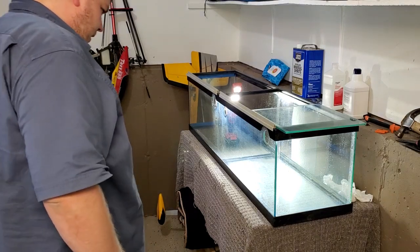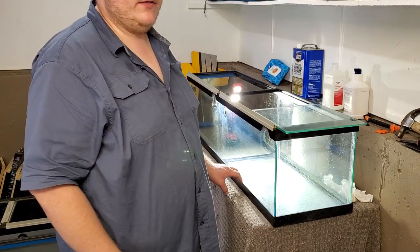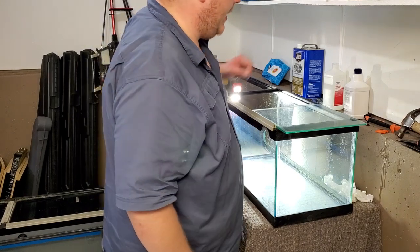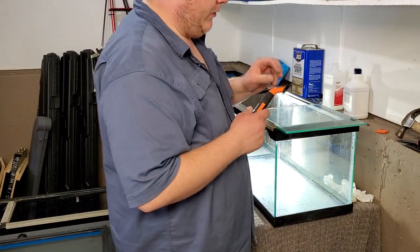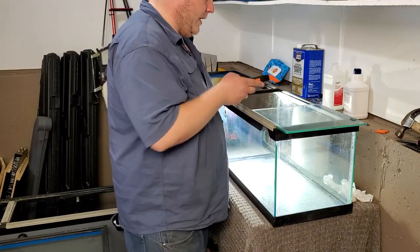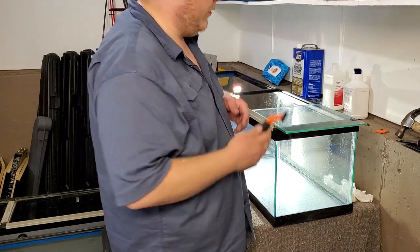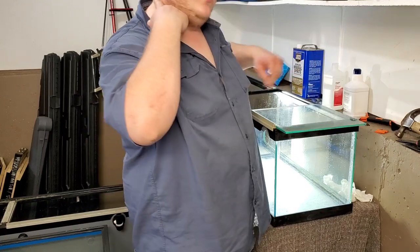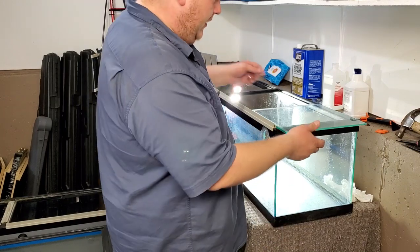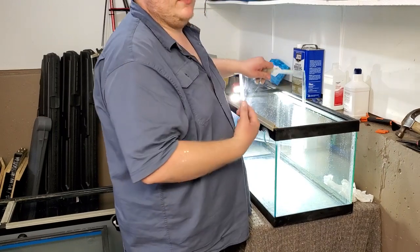Okay. So, I'm not going to mask tape around my silicone caulk. Lots of people say you should to get a clear line, but I'm pretty confident that I'm going to be able to do a good enough job with just my spreading tool. So, my plan is to go around, do the perimeter, do the verticals, and then get the center divider in all before the bottom dries. You know what? Maybe I'll revise that. I think I'll do the verticals first and the bottom last so it's as pliable as possible, because I'm going to need to place this within the caulk, fix the joint, and then caulk it vertically.